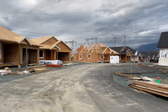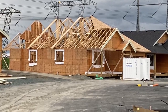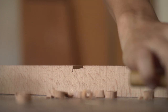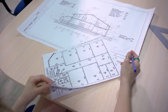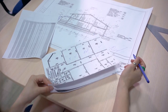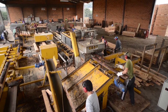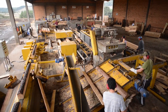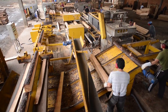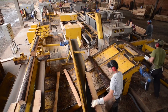The balloon method of construction — or platform construction as we use today — was an innovation that made building houses much less expensive. You no longer needed a highly skilled craftsman to cut the notches in the wood as you did with timber frame construction. With highly skilled architects designing the houses, compiling lists of building materials, and a large central factory with state-of-the-art machinery, the wood could be pre-cut perfectly and numbered. And with the use of nails — another building innovation — the average person was now able to assemble their own house, just like we assemble IKEA furniture today. The smaller boards were easier to handle and anyone can nail boards together.